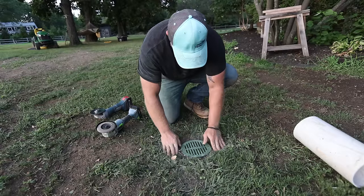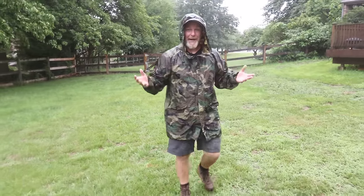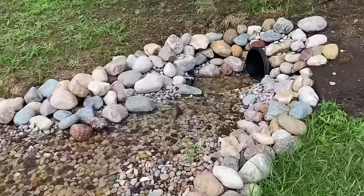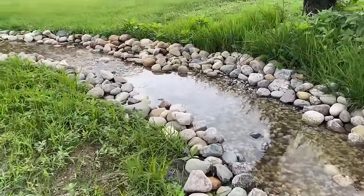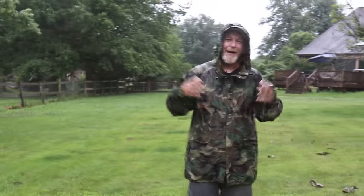All we have to do now is wait for the rain to come so we can test everything. After about four weeks, we finally have some rain and we can test this system — and to be honest, I couldn't be happier with the way it turned out. All of the water from our roof is coming straight down into our gutters and into those catch basins, which is then being taken into that solid pipe and dumped into the dry creek bed in front. Any groundwater that is percolating through the ground is being sucked into that French drain and also dumped out front. If you have any questions on the parts I used or the process, let me know in the comments. Huge thanks to Peddington for supplying the Ironite and supporting the channel. Thank you so much for joining me — I'll see you guys next time.